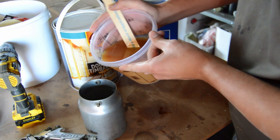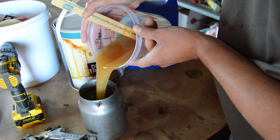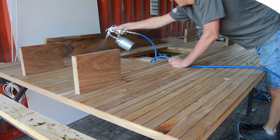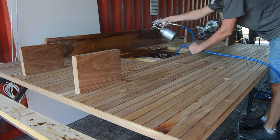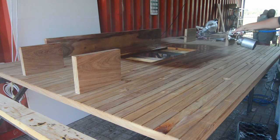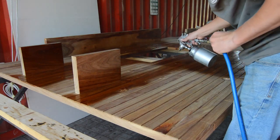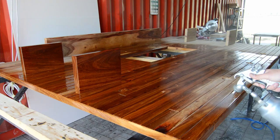For this project I'm going to use a spray-on varnish because it's a very large-scale project and spraying is going to save me a lot of time and money compared to applying by hand. Once I apply the spray-on varnish, I come back and give it a small rub in the direction of the wood grain, which gives me a much smoother finish.